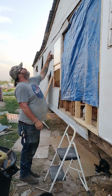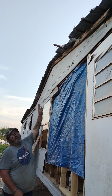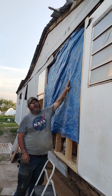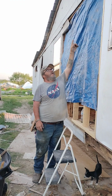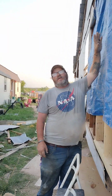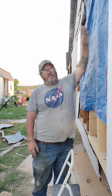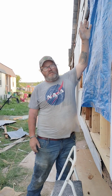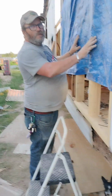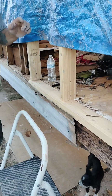Okay, so where the tin is damaged on the roof up here, the limb came through the wall here. It was said that this trailer is non-livable because it had a hole up here and it dislodged the wall from the roof. When I looked at it, I told the guy, it's fixable. It's still livable. It's an easy fix. So what we did is we took the old studs out. We put new 2x4s in, new 2x4 runner, and